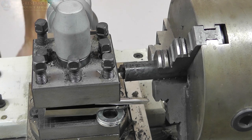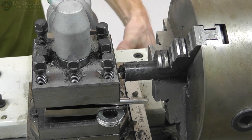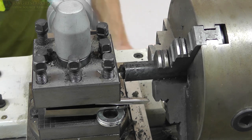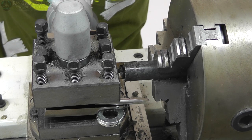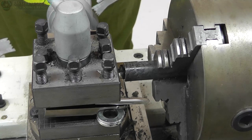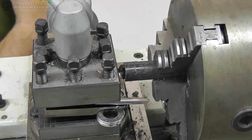Neither one of these two will move, and I will set the references at whatever I feel like on the indicator, because I do have a number dial visual indicator on telling me where I'm at. I actually installed those on this and that milling machine that you saw. So the same thing you saw in the other video with the numbers on it, that's the display. That basically is on this machine as well. And so it doesn't really matter where it's at. It could be at 100, could be at 5, could be at 10, doesn't matter. I'm referencing that always as I make these cuts. So basically I'm making the inside cut, the outside cut, referencing whatever number that is, and then I don't have to worry about it being off. Every one of these will be identical because I'm referencing where the actual point is.